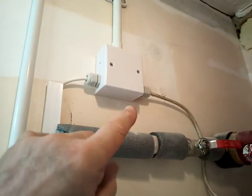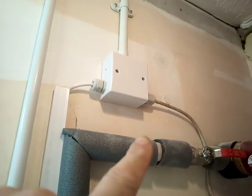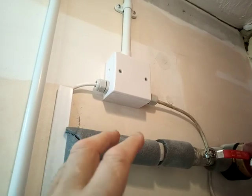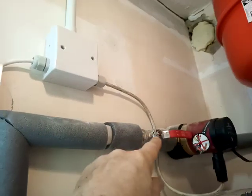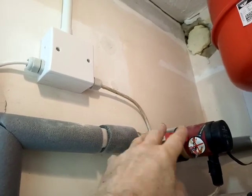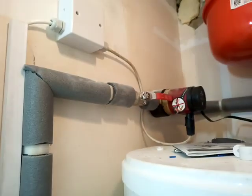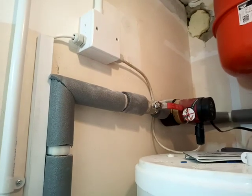He's got a push-button Sonoff switch at the kitchen sink, and in the bathrooms he's got PIR presence indicators which send a relay signal into this box to fire up the pump. So the pump will only run when someone is in the active zone. The customer worked this all out himself before I got here — he's an IT engineer.